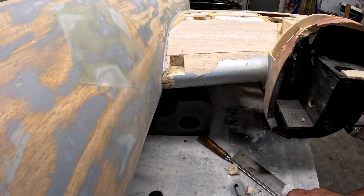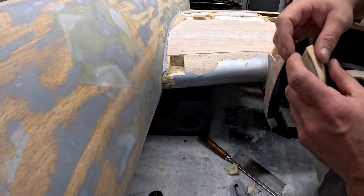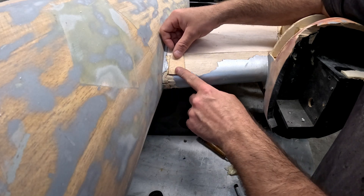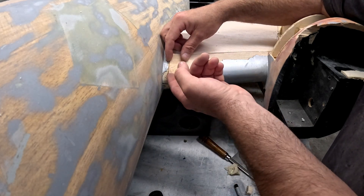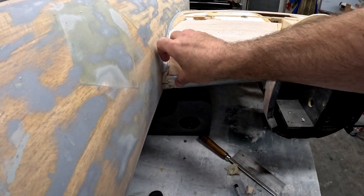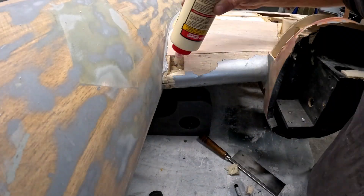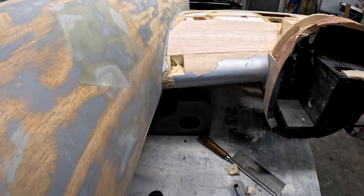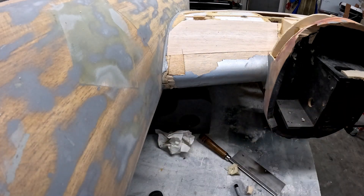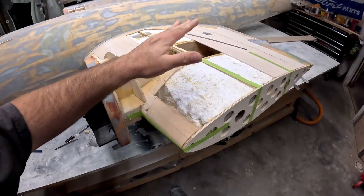So what I'm going to do is — I made this little airfoil-shaped wedge piece here, and it's a pretty good fit. It slides right in and with some force it's a nice tight fit. All I'm going to do now is take some Titebond glue and glue the whole thing back in there. Then I'm going to start making up the last wing skin for the top surface.